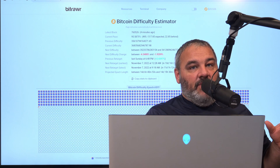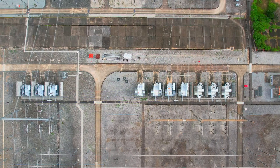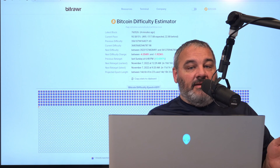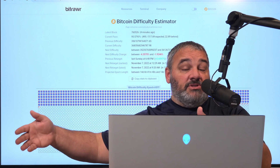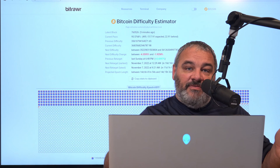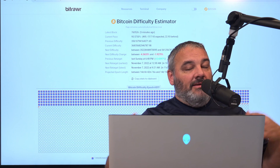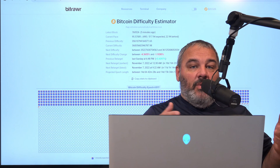What we're going to show you today covers situations where you're looking to expand your Bitcoin operation and the power company tells you they'll step down from 13.8kV high voltage into a transformer like a 2,500 kVA — about 2.5 megawatts of power — coming out at 480/277. Typically you'd need switchgear to step it down for fault tolerance, then into a smaller 500 kVA transformer to give you your 415/240 conversion. That whole setup with switchgear will probably cost you a couple hundred thousand dollars.